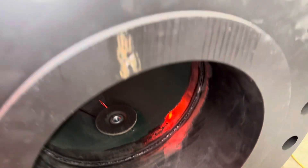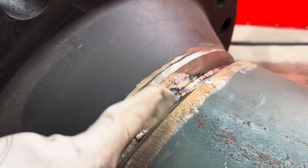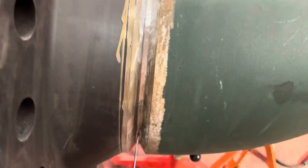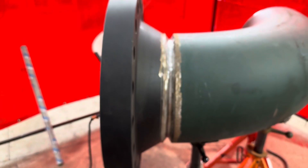With the hot pass we're going to be running about 160 amps. Before we hop to the hot pass, we're going to grind down all this trash from the root pass. Every time you want to pop off, you always pop off to the bevel - keep that in mind, don't let it sink into your root. Grinding your root pass down, making sure there's no trash in there - you're gonna want to get a wire wheel because sometimes you'll miss a spot. Most likely it will burn out but why take the risk. Just go ahead and grind it off, make it clean, and inspect the whole root making sure you didn't leave any little bits of trash in there.